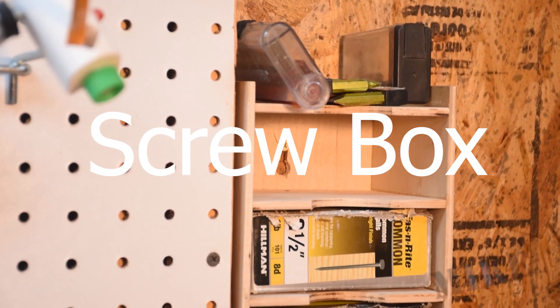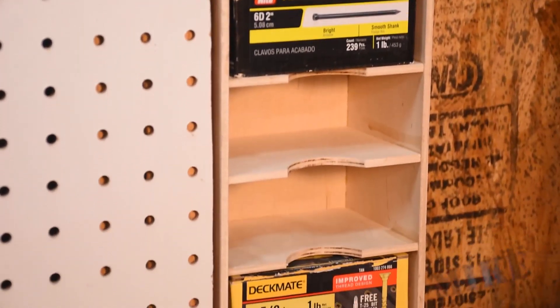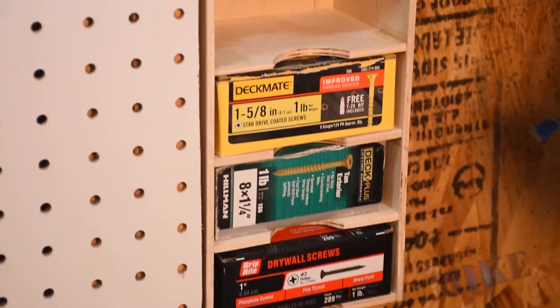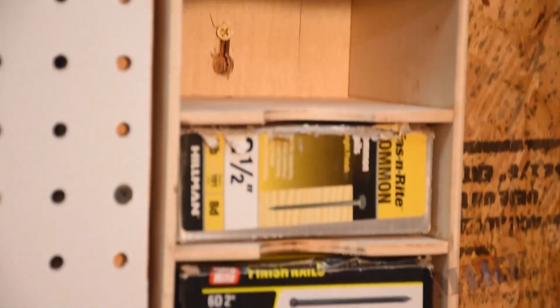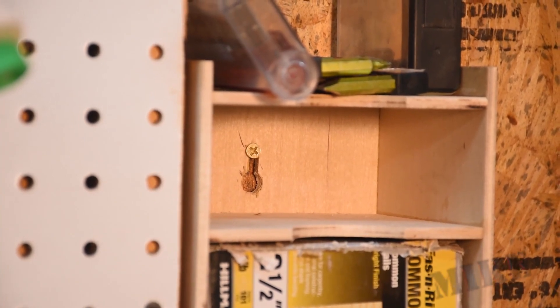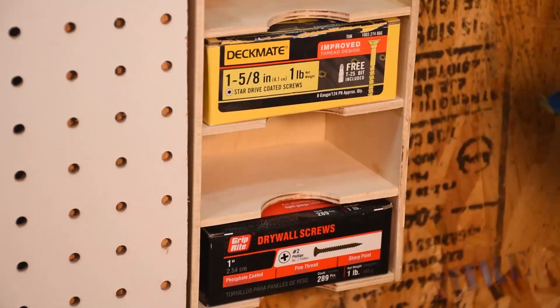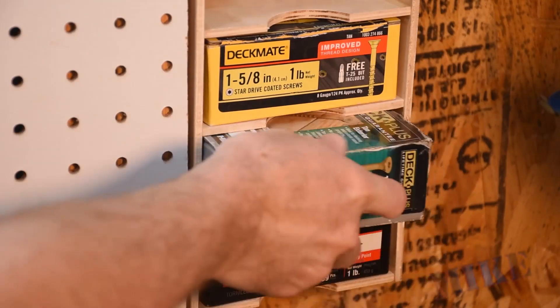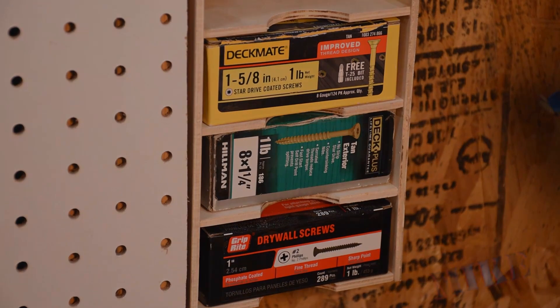Number three: the screw box. I have lots of one pound boxes of screws — more than I even have here. I made this little holder out of 1 and 1/8 inch Baltic birch. It's supported by a single screw in the wall on a little key slot. There's even a little tray at the top for miscellaneous things. I bandsawed out some finger holes so that you can easily get each box, and you can see they come out very easily. I used some spacers for each of these shelves so I didn't have to measure them — the spacers were slightly taller than each box.